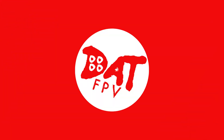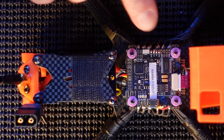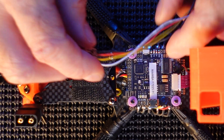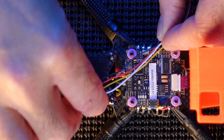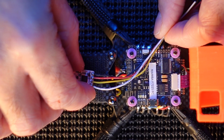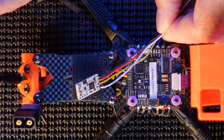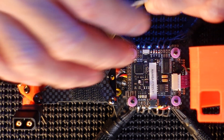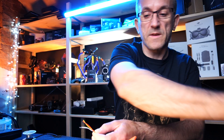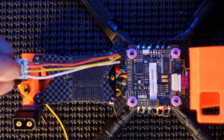So what I'm going to do now is just tin the ends of these up here, and then we're going to wire these into the flight controller. I'm going to look at what I'm going to be doing — I'm using this quad here for my testing purposes. The connections I need are right here, and you never really want a massive bit of cable. So I'm going to roughly get a place that I want this to go — I'm going to feed it under the flight controller, maybe sit it around there. There's going to be a bit of slack, but I think that will be ample because these antennas are connected on here, and I'm probably going to feed them under and through. Make sure you've got the right sort of length cable — you don't want it too long, but you don't want it too short either.